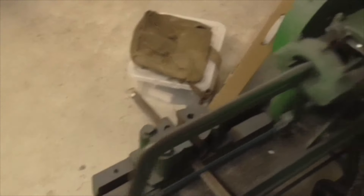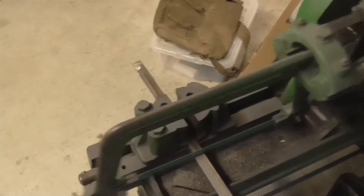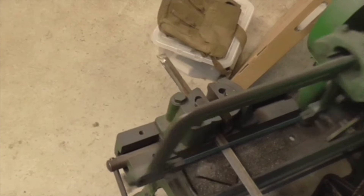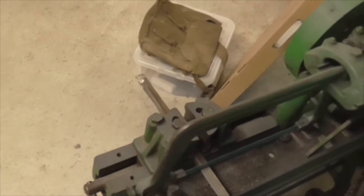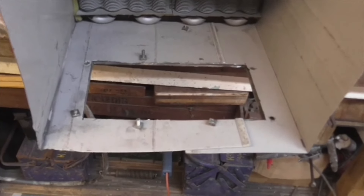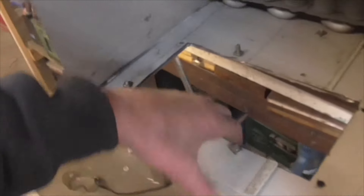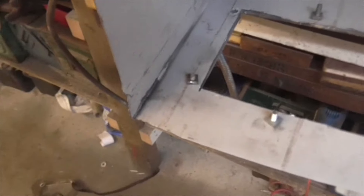Making the frame that goes around the big fan — I want the frame on the inside with bolts welded through so it's easy to fit and take off. The Mantis does all the work fine. There's the fan gap cut out and I've made a metal frame to go inside to reinforce it as well — coming very close to completion.